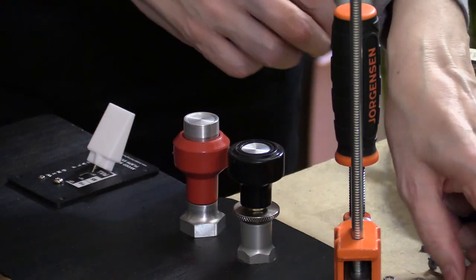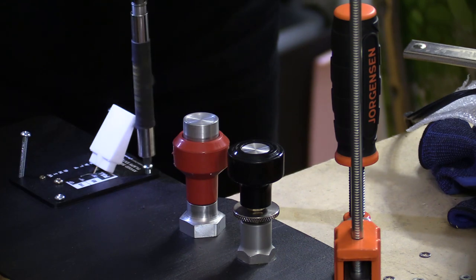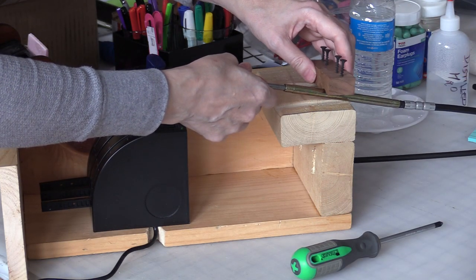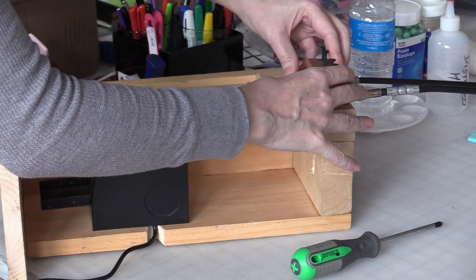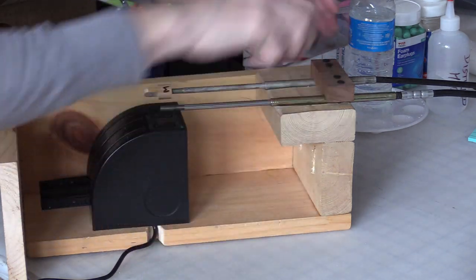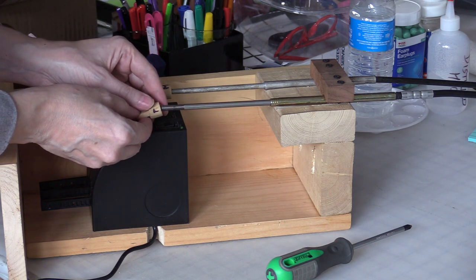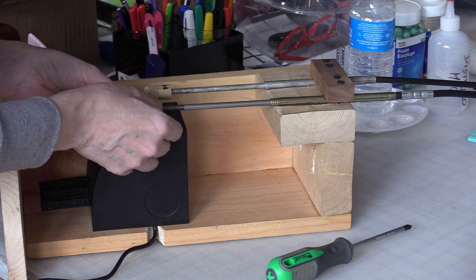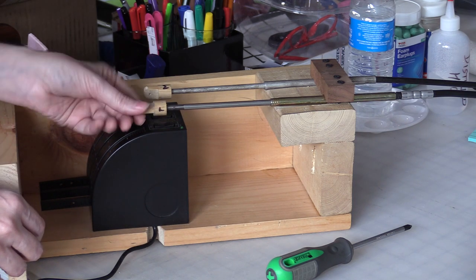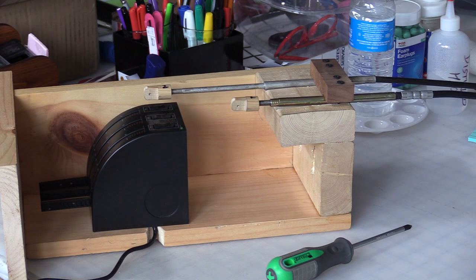Back at the lab, mounting all the controls in the panel — pretty straightforward, everything went as expected. Using number 6 screws with locking nuts on the other side. Lining up the block with the two cable assemblies. This is what the artificial thread looks like inside — it works very well. I wouldn't use it for something pulling tremendous weight, but for something like this the thread was more than good enough. It sure beat all the other alternatives as far as time and effort goes.